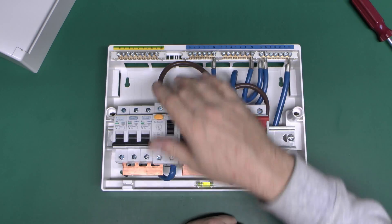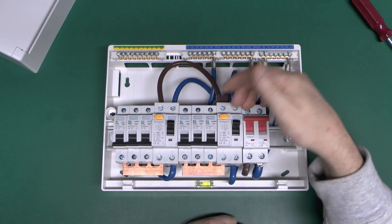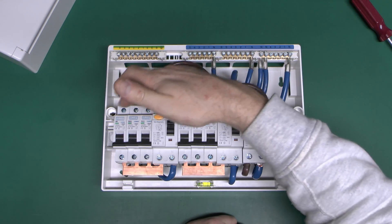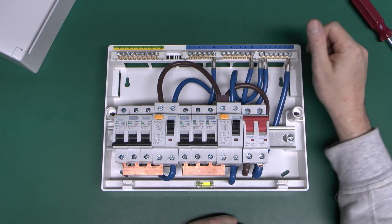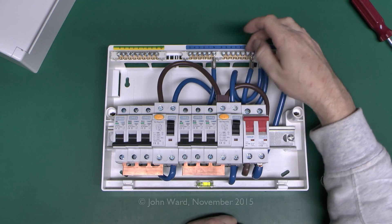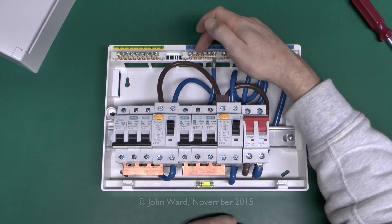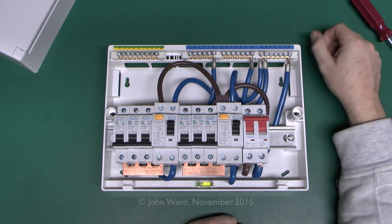You've got your numbered connections there for each of the circuits. If you're going to fit these in, it's the recommended method to put these in the same order as they are on the circuit - so you number these one, two, three, four, five, six, and connect to the appropriately numbered terminals there as well. And the same for the two neutrals - you'd have three there going to the first three here, and those three going to the three there.